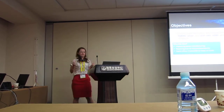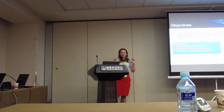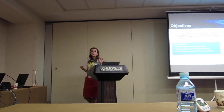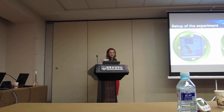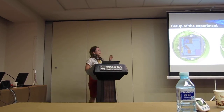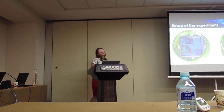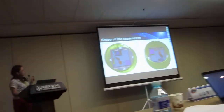What makes our project unique? We use a high-powered 25-watt laser in a pressurized box. We are going to repeat the experiment both on Earth and in space, letting milligravity be the single variable that differs between the two experiments. This is the setup of the experiment — we modeled it in SOLIDWORKS to ensure every part fits in the rocket. The yellow cylinder represents the rocket module with a diameter of 34 cm and a height of 22 cm. We have the laser under the black box, over here, which is the heat sink — placed there to cool it down.